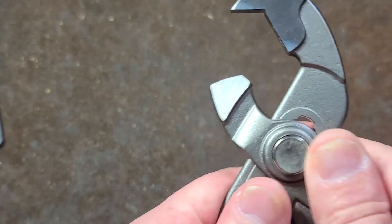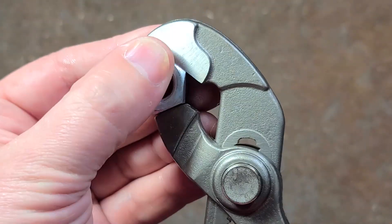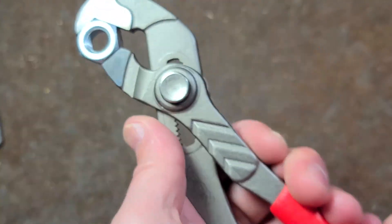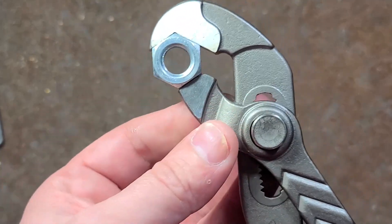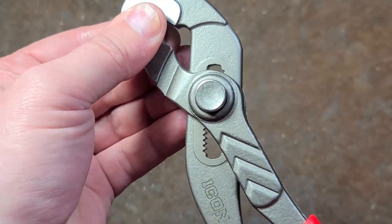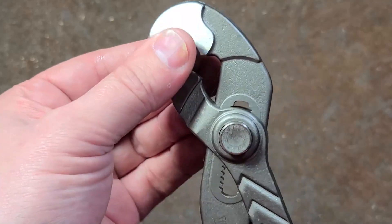So this angle was just curved over a bit more than it would really be self-tightening. And that's the idea behind these parrot nose pliers — kind of versus an adjustable wrench, you get not quite as much strength, but still plenty of strength. You put the fastener in and then as you push on what we'll call the adjusting handle or the moving jaw — this would be the fixed jaw — as you squeeze and put more pressure on it, the idea is that this jaw pushes into the side of the bolt. You're grabbing on three sides and it helps bust the nut.